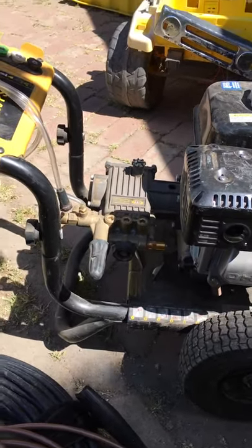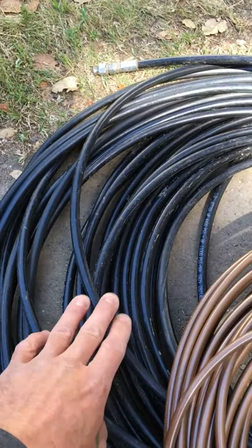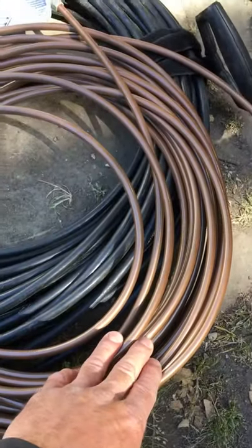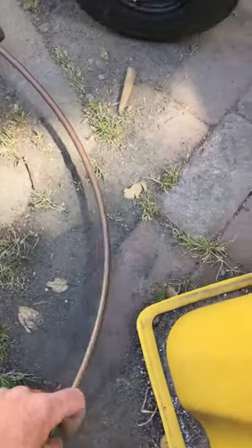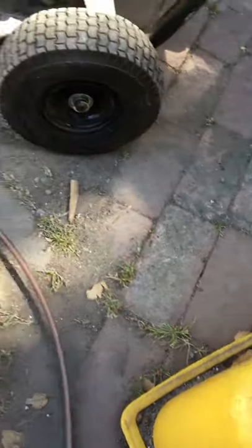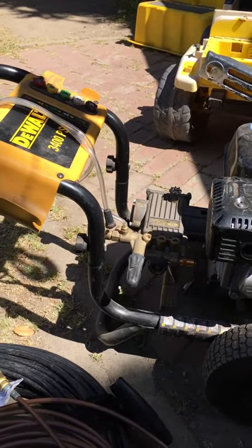The other good news is that you can now jet your main line. This main line hose here does up to like 5 inches, maybe a little higher. This smaller line is for your inside lines — it does 2 inches up to like 3 inches. You're also going to have to buy tips. You'll want different tips: ones that bust through, ones that spray back, and spinning tips.